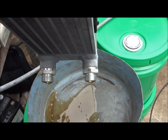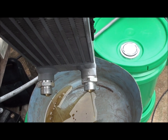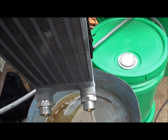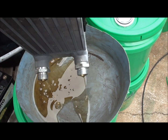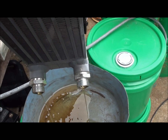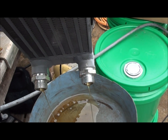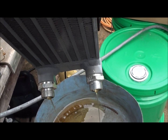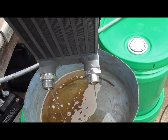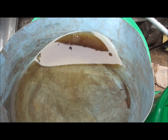What kills me on some of these machines — look at the amount of fluid in here. You can never get this out. There's no drain on the bottom. So if you've got contaminated oil and you're trying to do an oil change, this makes it really tough — especially if you're trying to flush one of these things. You've got all this residual oil you can't get rid of, except by removing the cooler. If this oil had a high acid number, that could make a pretty big difference.